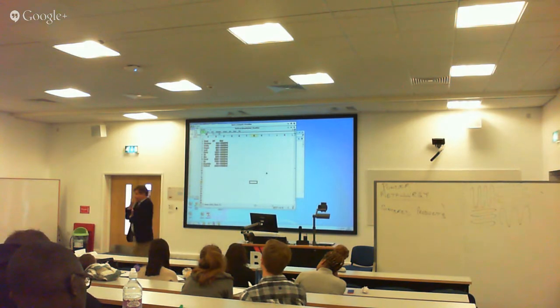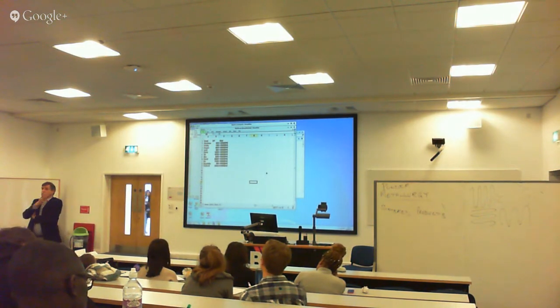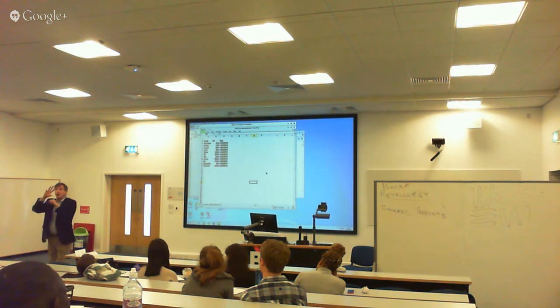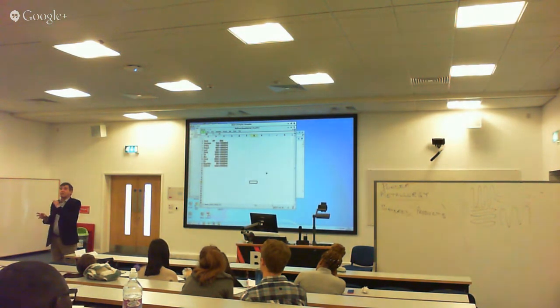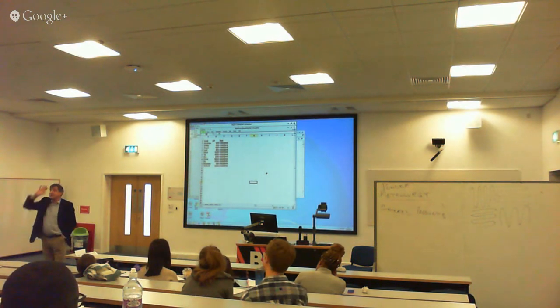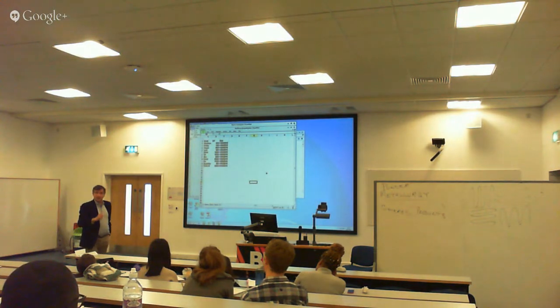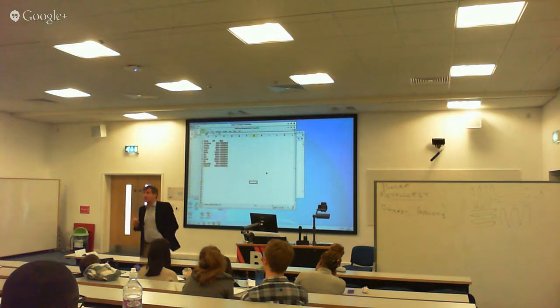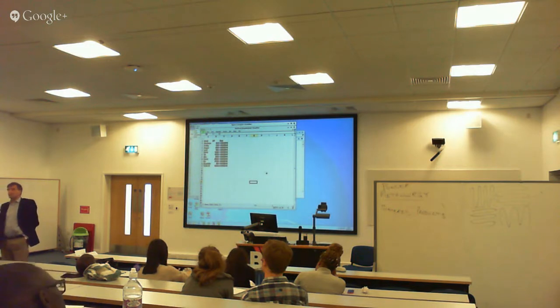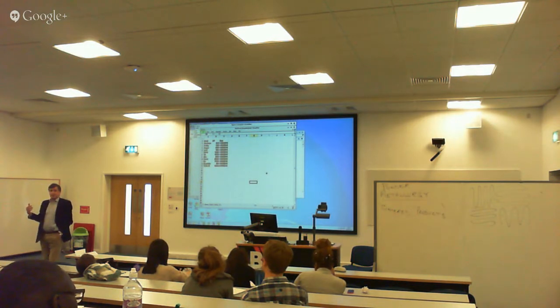What are the advantages? You produce something like a casting, but the dimensional accuracy is much better than what you get in casting. You can actually get very good gears, precision gears. You can make precision components out of it. You get good dimensional accuracy, better surface finish, and better toughness and strength than castings. Not as good as rolling, not as good as forging, not as good as extrusion, but better than casting.